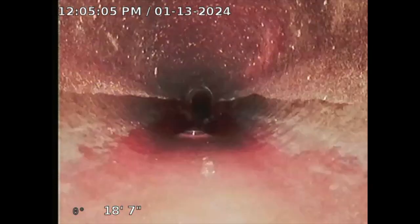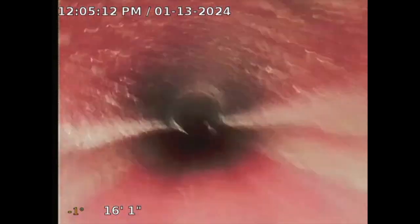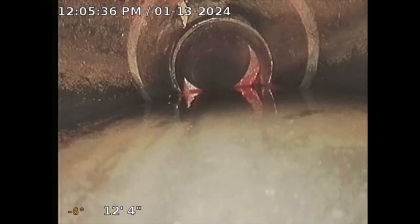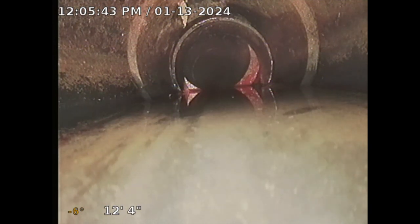Retracting now. It looks good except for a few cracks and a joint offset we're about to see — from the connection to the right there. See that — it's kind of big and it's located 13 feet out. Toilet paper can just stop right there. I'm under water. That's troublesome because it could cause backup. It looks like the ABS closest to us, proximal to the clay pipe, is sagging and there's a big joint offset with standing water.